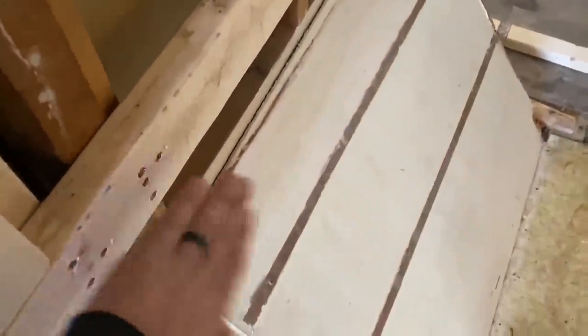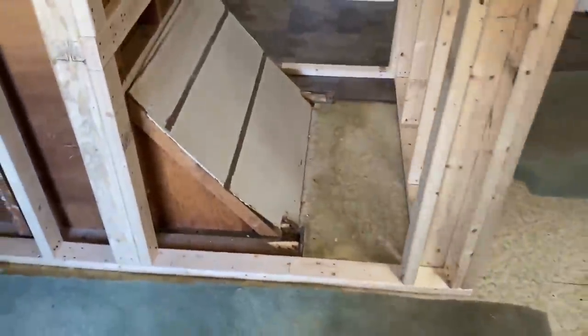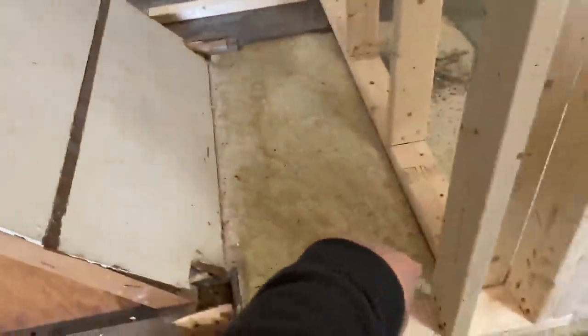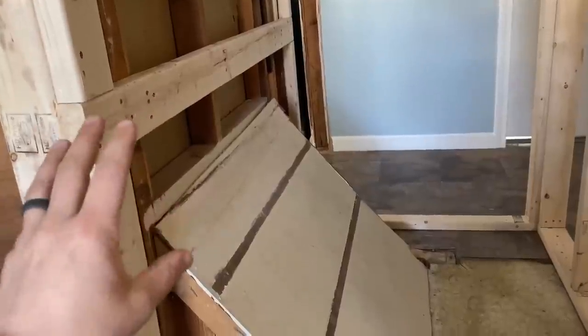So I know what I'm gonna do. I'm gonna try and get the most space I can in these closets while still getting a nice head clearance in the basement. I'm gonna do the best I can. If I was to do this square, it would go from here to this line right here, just like that. So as soon as you open that closet, it would be plywood right here and a plywood top on each side. If I did it just at an angle and did the entire thing like this right down to here, then you would have a similar situation. This would be plywood at an angle, but I need that head clearance. So I'm gonna try and kind of split the difference here.